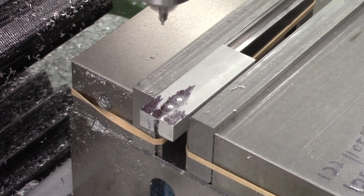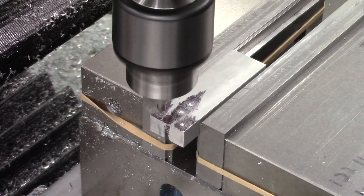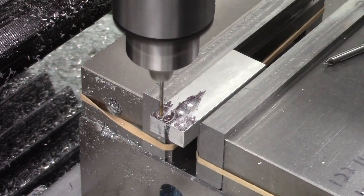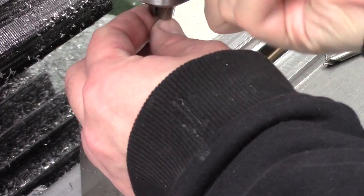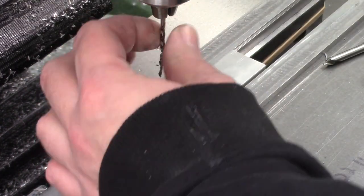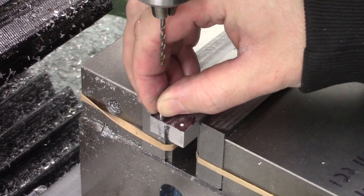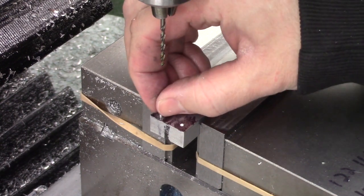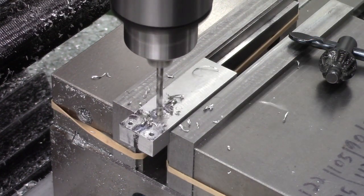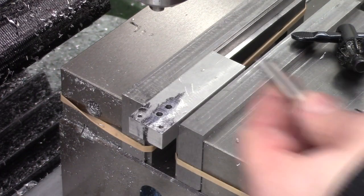After that it was time to drill the holes. When drilling holes, always mark the stock out with either a black pen or some Dykem and then scribe some witness marks where the holes need to be. When you're using the DRO and offsets it's really easy to miss the holes, so just putting a little witness mark stops you from drilling in the wrong position. We centre drill all the holes out first, then come back with the respective drill bits. The two at the front need to be 2.5mm — a nice good snug fit on the pin. These are the pivot point for the cocking handle. We're making R1 out of aluminium, so we want a nice good press fit for the pins, that way it will take a lot longer for the pin to wear loose. To get a nice tight fit we're using a 2.3mm drill bit first as a pilot, and then a nice sharp 2.5mm straight after — and as you can see, the test fit on the pin is a nice snug fit.